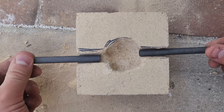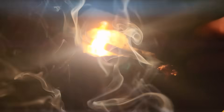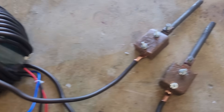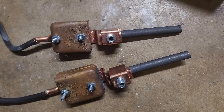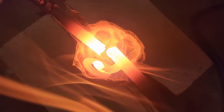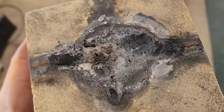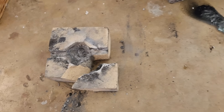To serve as a furnace, I drilled some holes in a fire brick for a pair of carbon electrodes to go inside. Even with a welding mask on, the arc is pretty bright — there's so much light that it's bouncing off the walls and lighting up the inside of my mask. I connected the wire lugs and carbon electrode lugs to big copper blocks to serve as heat sinks, because even a few inches outside the electrode holes is blazing hot from the radiant heat. While it did protect the wires, the carbon electrodes would get stuck in the furnace when the ceramic fire brick began to melt.